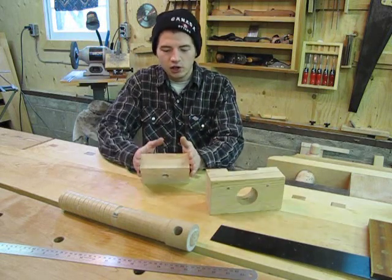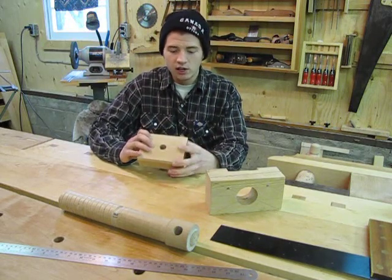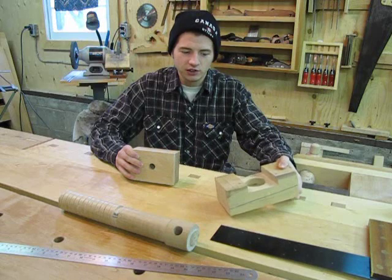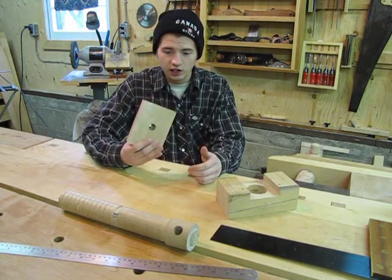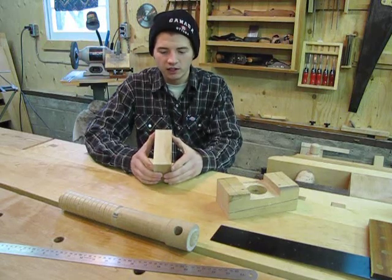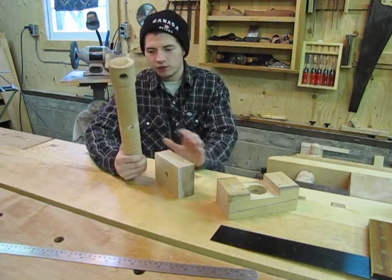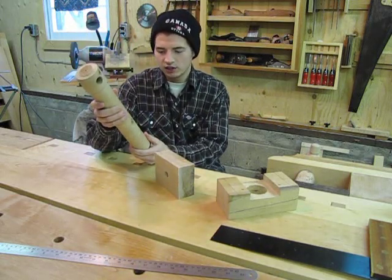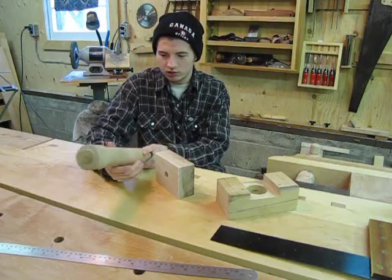That's why I'm doing mine only five inches thick. Ideally this wouldn't be great, especially if you have a larger size hole. But this guide is going to be a slight modification to this one, and you'll see why having such a short piece will be just fine later. So after you have the hole in your guide drilled, the next thing you have to do is cut the kerf for the steel plate. But you can't do that until you get the dowel for the tap made, because you have to get the dimensions for the spiral and the pitch set up in order to cut the kerf into the guide. So that's what we'll do next — we'll start work on the tap.